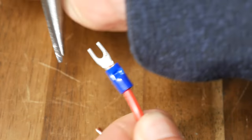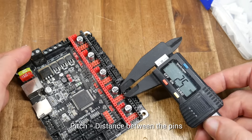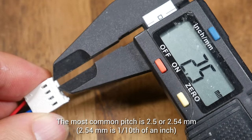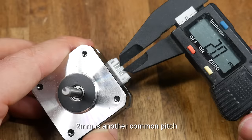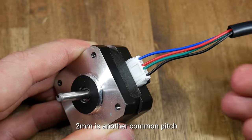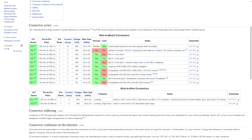A strong mechanical joint without the need for any solder. Crimping is a mechanical connection that can't melt when it gets hot and doesn't introduce any brittle points like soldering can. So what does pitch mean? Pitch is an easy to understand concept — it's just the distance between the pins of a connector. For 3D printer hardware, the most common pitch is 2.5 or 2.54mm. However, there are some components that use a narrower pitch, such as the plugs on stepper motors. A NEMA 17 typically uses a narrower 2mm pitch, so your connector has to match if it's going to plug in. The pitch of any given connector may or may not be labelled on the box, but you can always rely on free online references that go through all of the connector specifications.